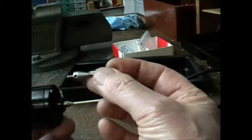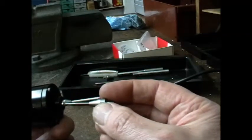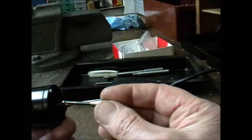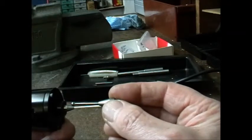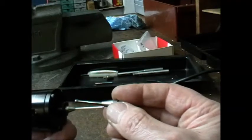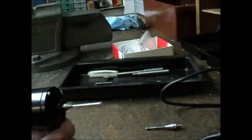So as a quick summary: I've made a stiffer stylus which has a three millimeter carbide shank and a four millimeter ball, and it almost completely solves the problem — about 90% solves it. It's very stiff, so the varying pressures from the different angles isn't really a problem. But I thought it would be even better if I could come up with an overload protection device, so that if you pranged it you wouldn't damage the internals of the probe.